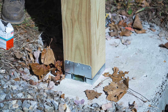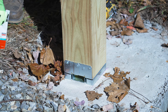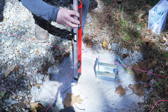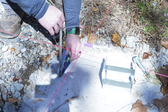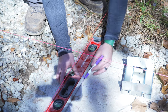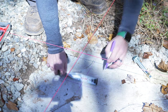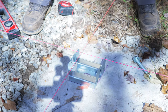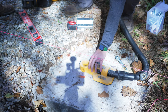With that done, we could finally get our post base brackets set in place. First we needed to transfer the string location to the footings — a plumb bob would have probably been the easiest way to do this, but I somehow don't own one. I initially tried to use a level but that proved to be a pain, so I switched to using a combination square with a built-in level, which worked great. This first bracket would be centered on the string line, so I moved my marks over two and three-quarters of an inch and then marked where I needed to drill the five-eighths inch hole for the five-eighths inch anchor bolt.